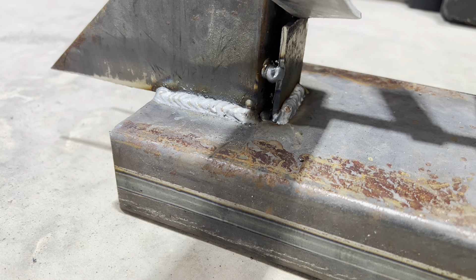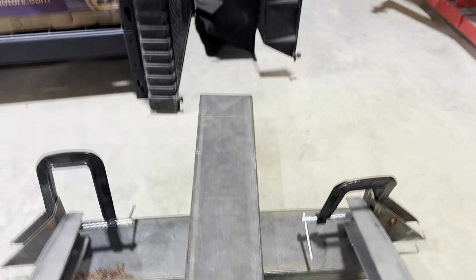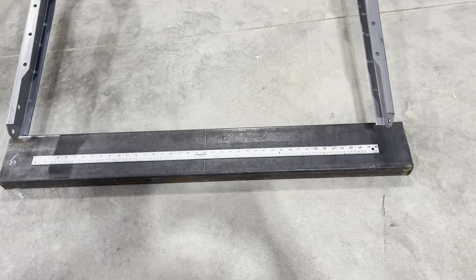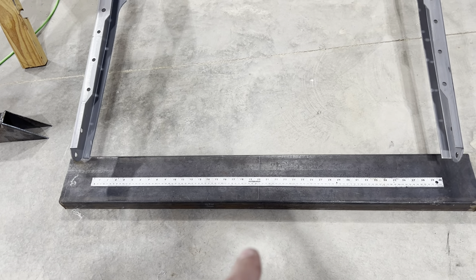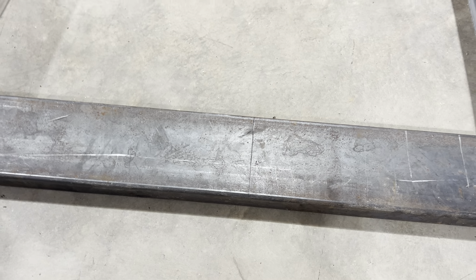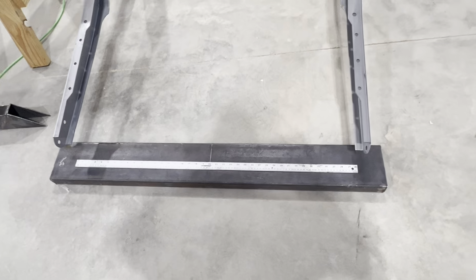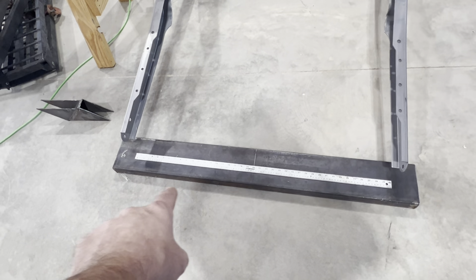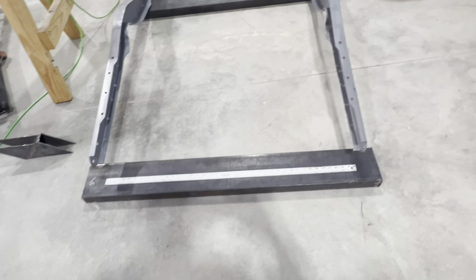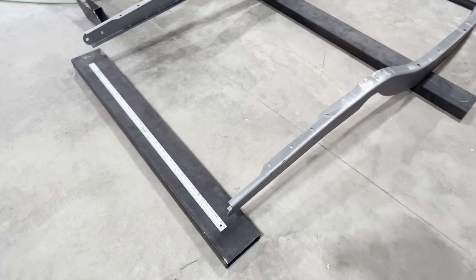In the back here, it's 40 inches side to side, so I'll mark 20 either side of my center line, which I have in there. I actually have them scraped in there with an awl, so I'll have a really crisp, clear center line. On these back ones, I'll take some of the same bar — I think that's 2x6 — and I will use my chop saw and chop me some posts for the sides, just like in the front. Then I'll take those same tabs, except instead of 2 inches, they've got to be up 2 and a quarter in the back.